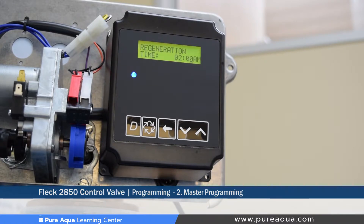The next step is setting the regeneration time — the time of day the regeneration will begin. If you have more than one system connected in series, such as a multimedia filter, a carbon filter, and a greensand filter, you want to stagger backwash times so they never occur simultaneously. For example: multimedia at 12 AM, carbon at 1 AM, and greensand at 2 AM. We'll keep ours set at 2 AM.